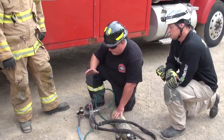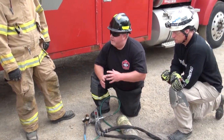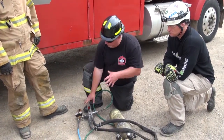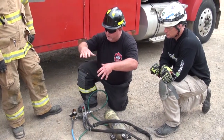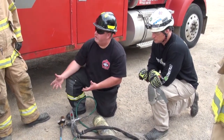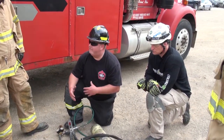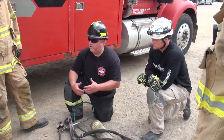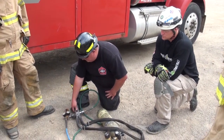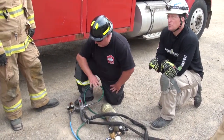When we're done, we can use the red button — hold down on it. Once we raise the load a little bit and unlock that strut, the red button holds those locks open the entire time. So you hold the red button down, the locks stay open, and then as you let the airbags down, the struts will actually collapse themselves and come down from the pressure of the load. That's why we don't want to put too much air in them, because it may start lifting. It's a 15-ton strut. We just push a little air to it, get up to about 2 bar, and we're good to go. The C button on the backside clears the system so when we're done and want to take the struts out, we hold it down until there's no air pressure and the struts will just come out.